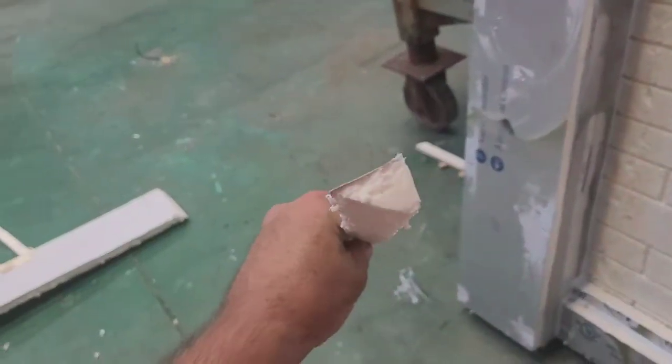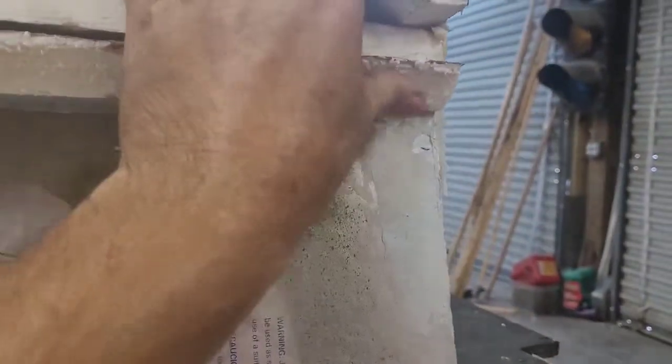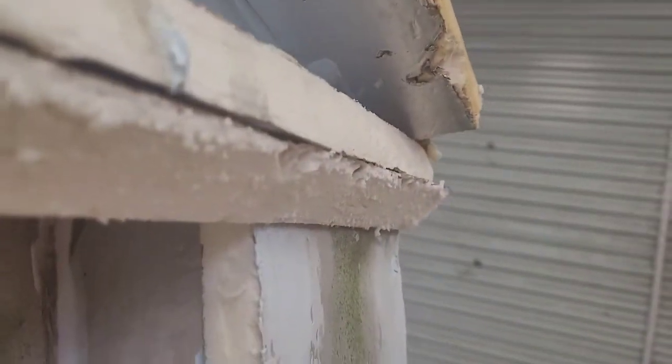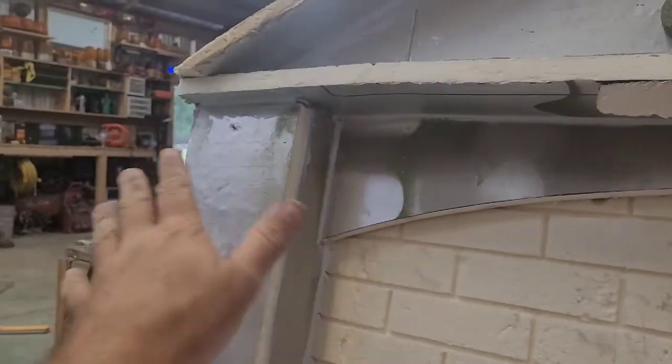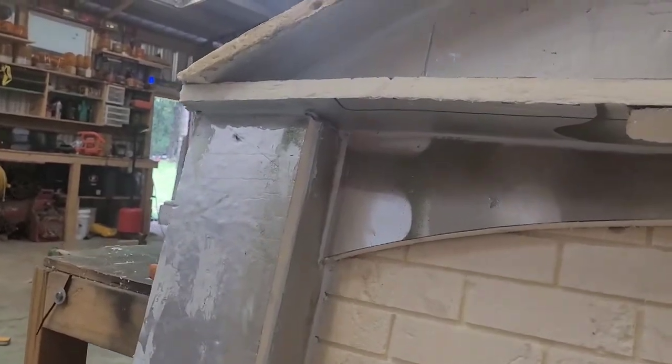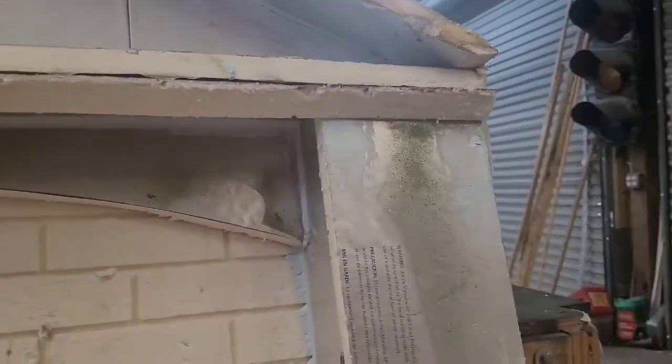The one thing I wanted to show is what I meant by doing bevels. Right now this one's all just square corners, no detail really to them. On a lot of them, I'll take my table saw and feed my foam through it and make a little wedge, like a little triangle piece. Up here you could stick that right here, and that gives you a little detail to it. Then you could always 45 this corner and run it back here and then straight across, so you give yourself a nice little bead detail or a cove detail across all the lower sections. You could run it across the top section up here just to give it that little extra, to make it look a little bit more fancy.